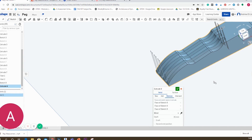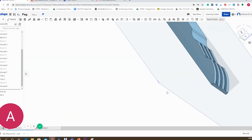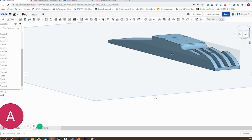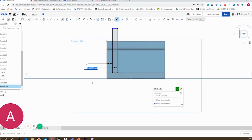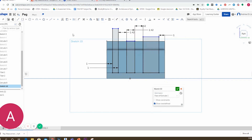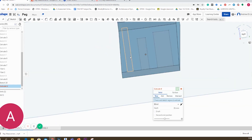I'm removing material, then I need to choose the right depth. Make sure you're measuring constantly against your peg. At this point I think I went a bit too deep, so I had to reduce the depth of my cut. From the other end of the peg, I had to do the same thing again — this time the dimensions were slightly different, but I made up for that through measurement, so my cut will look slightly different.